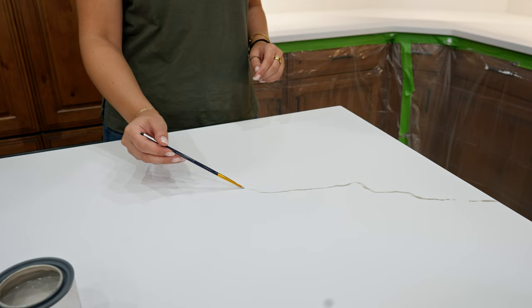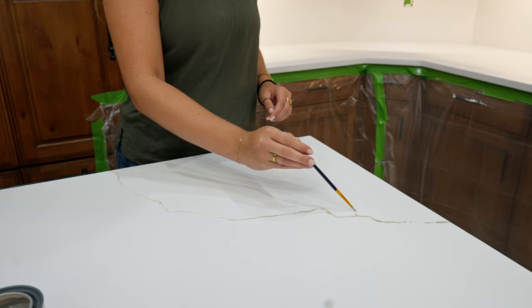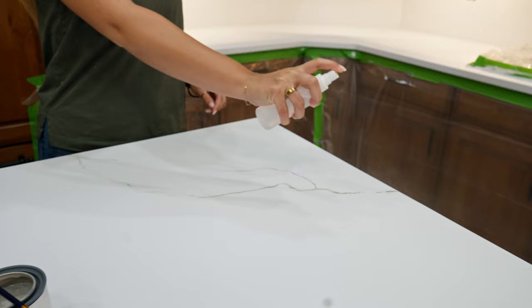Smoky quartz and graphite can be used interchangeably to create the main outlines of your veins. We chose to use smoky quartz to match the warm tones of the space. Next, spray your vein with water. You'll know you used enough water when the mineral paint starts to bleed.